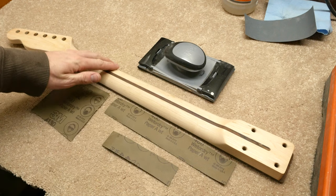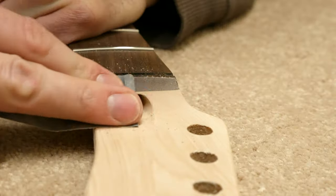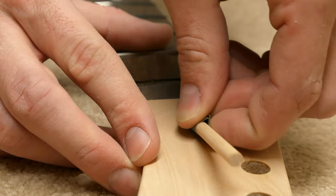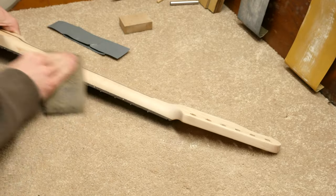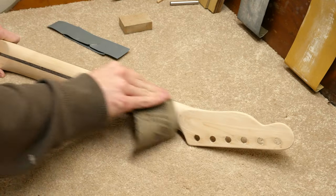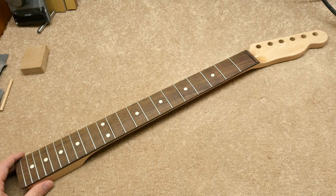After finishing up at 320 grit, we need to sand with 400 grit before moving on to the final grit of 600. With these higher grit sandpapers, you really aren't taking off that much wood — the sandpaper is mostly buffing the wood and you should start seeing a nice sheen develop. We have now reached our final sanding grit of 600. The oil finish I chose for this build, Odie's Oil, soaks into the wood and does not create a film on top, like some polymerized oil varnishes. This means the sheen of the finish is solely dependent on the surface of the wood. In my experience, 600 to 800 grit will produce a perfect satin sheen. If you wanted a higher sheen, you could sand up to around 1500 grit. I personally don't like sanding past this as I feel the wood doesn't absorb as much oil due to the smaller and more closed sanding scratch patterns. We officially have the neck fully finish sanded to 600 grit.